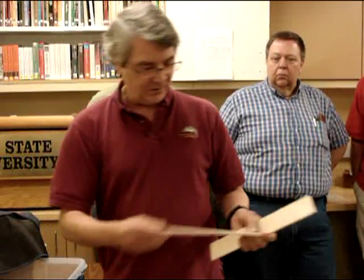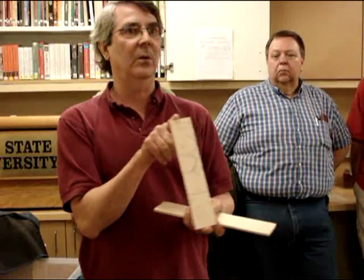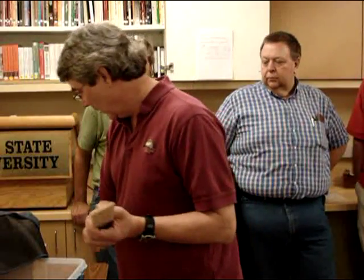There's the legendary spindle-turner story stick. This probably works with balls and bases if you want repetitive stuff. If you ever want to do a tapered hole in something, you can take one of these spade bits and grind it to whatever shape you want. George Hatfield showed he'd ground it a certain way and it stayed on center and bored a perfectly true hole. We also did it for candlesticks — you know that taper shape.